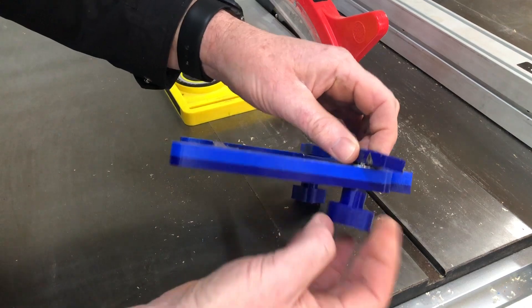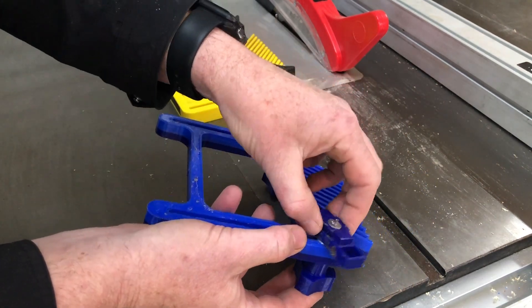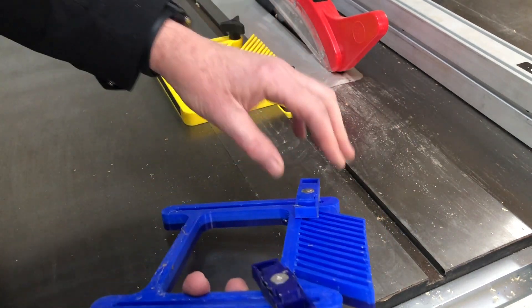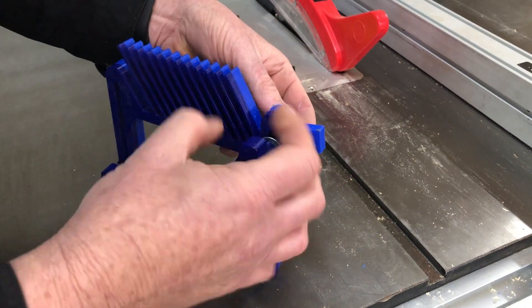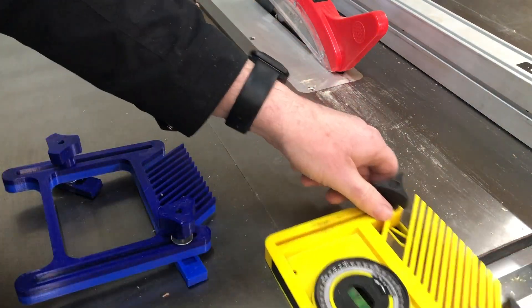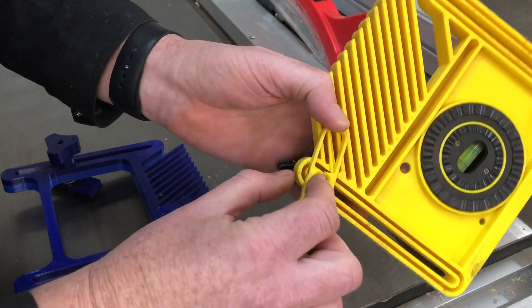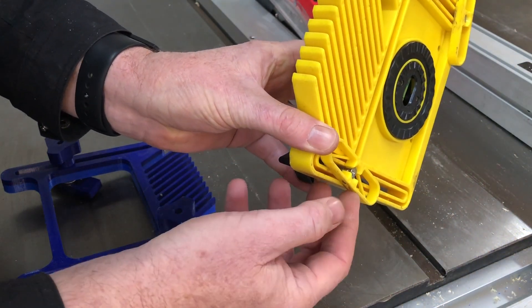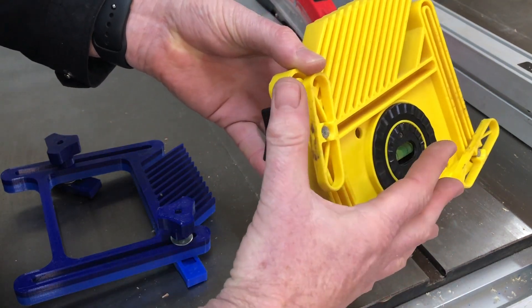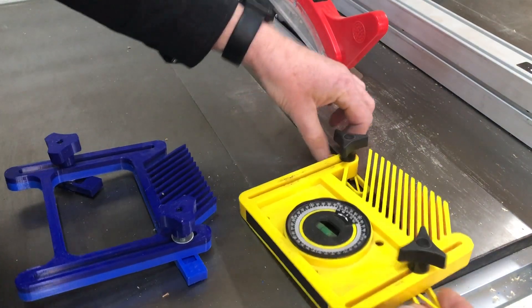At the moment we've got a bolt that pushes a dovetail piece of plastic into a plastic frame, and that plastic frame is a little bit on the difficult side to get in and out of the mortise. Whereas on the purchased one, they just use one piece of plastic with a small conical hole and a countersunk head screw, and as the screw is pulled in it just pushes the sides out — very simple, very effective, and easy to get in and out of the slot.